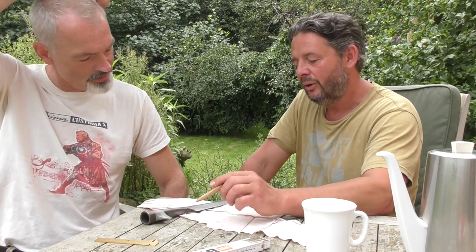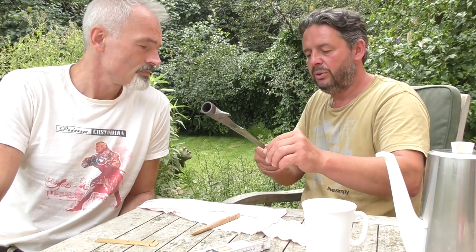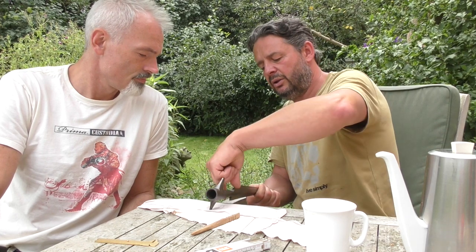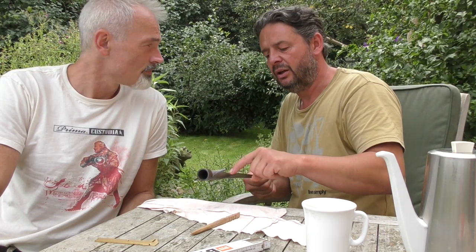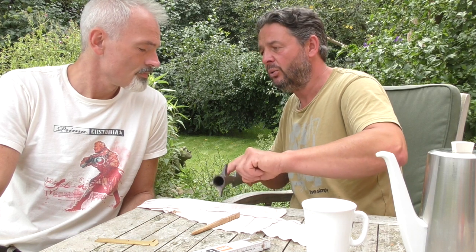It makes sense to do it, because then you can weld it now that it's square. So you heat it to the right temperature, you put it on the anvil and you hammer here, which means you weld this one and also that one, of course. The anvil does the same work. Then you turn 90 degrees and you weld this one. Done. The only thing that you haven't welded is these little corners, so you heat it up again and then you hammer over the corners, you make it eight-cornered.